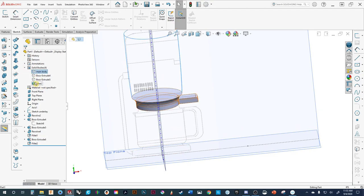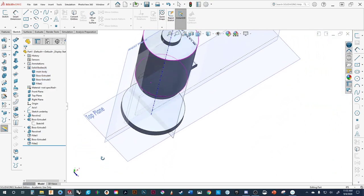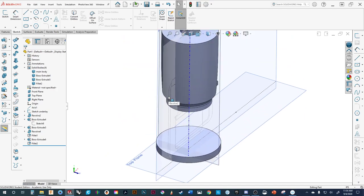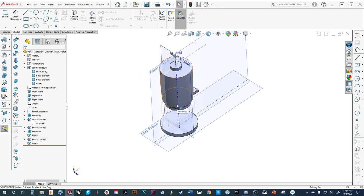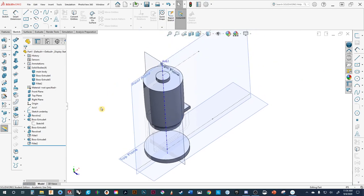What I'm thinking I'd like to do is build this bar here. Even though it is a 2D sketch at a straight-on view, the design intent for the actual product is to have two of these bars to provide support. So we're going to build that at a 45-degree angle. In order to do that, we need to create a new sketch plane to get these bosses coming off. We'll create a new sketch plane using the front plane as our reference.